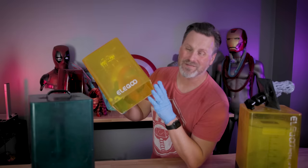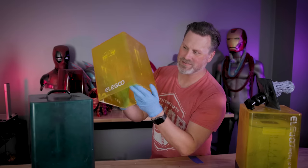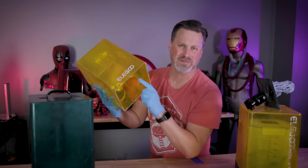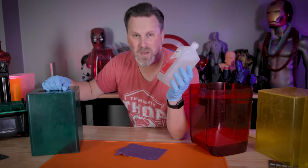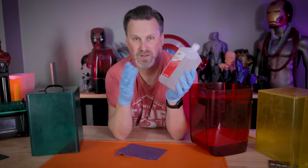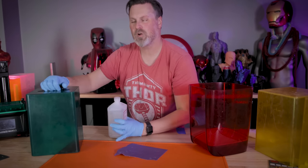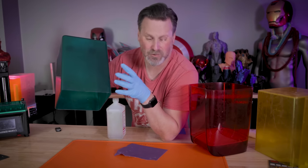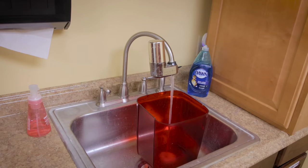I'm also pretty guilty of having some fairly disgusting looking resin 3D printer acrylic tops — like this one that has resin somehow cured on the inside of the panels. What I'm going to be using to clean off the acrylic panels is not isopropyl alcohol. You might think to use isopropyl alcohol since it's used in washing and cure stations to clean resin prints. However, when you rub isopropyl alcohol on acrylic panels, it causes them to dull and fade even more.